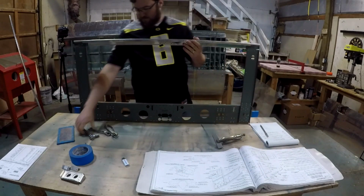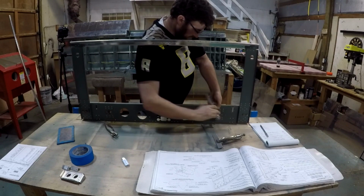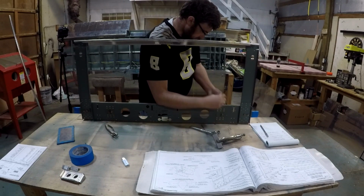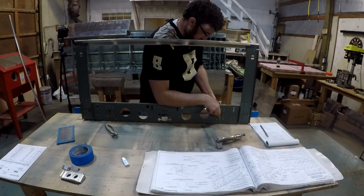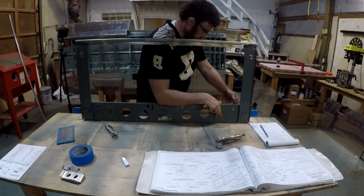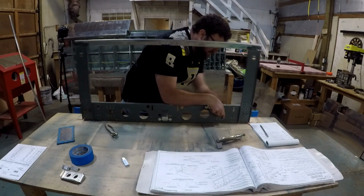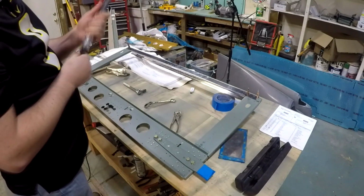It does get kind of frustrating sometimes that it just springs on you, hey, you need this, by the way, and, oh, okay, now I've got to wait a few days for that to come in before I can finish this step. So this has been one of them where it just says, hey, you've got to ream this. There are 4 holes on each, the left and right side. Ream all 4 holes for those bolts, and then they're AN5s, I believe.